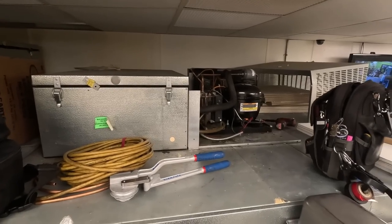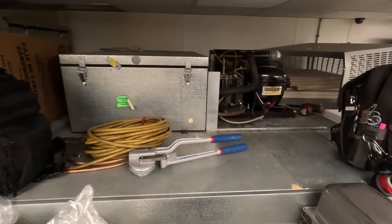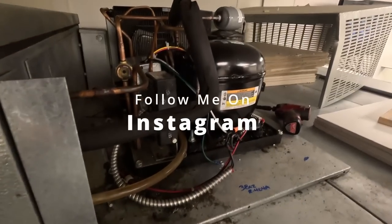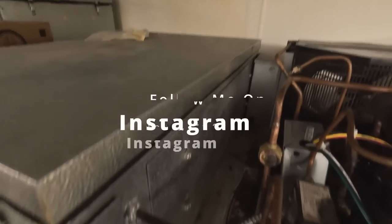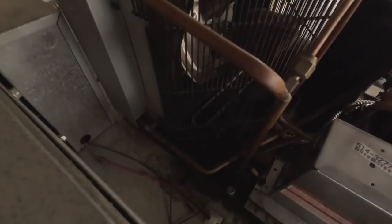All right, guys, I got us a little walk-in cooler here that I was out on a while back. Got a refrigerant leak and took care of some dripping in there and cleaned the pan out that was really, really bad shape. Well, while I was here, I ended up finding a leak in the condensate pan down here. And as you can see, it gets ate up, and that 3/8 line down there needs to be replaced. I tried to order it, but we couldn't get it. So we're gonna make a new one today.